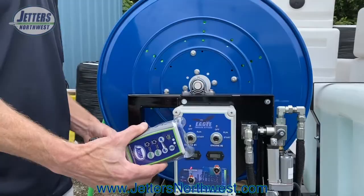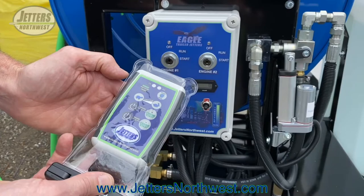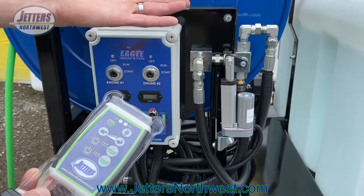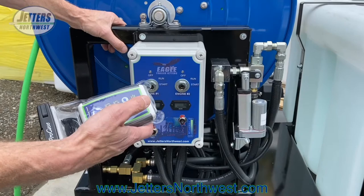Let's talk about what is on the remote. Starting at the top, the most important thing is the jetting on/off button. We put that so it's just handy right underneath your thumb. I can push the button and if we were running, this valve opens and sends water to the hose and the nozzle so we're jetting and the pressure builds. Push the button again it retracts, and it doesn't cut off the water — it basically redirects that water to the water tank, so it's creating a recirculation mode. Simple: push the button, it opens up jetting; push again, not jetting.